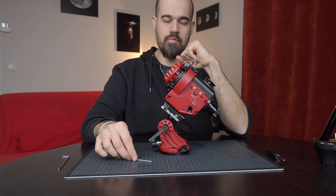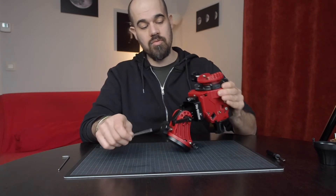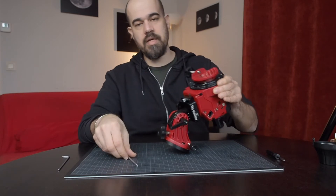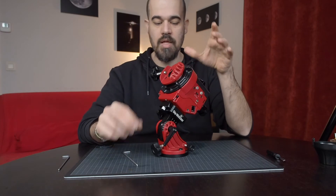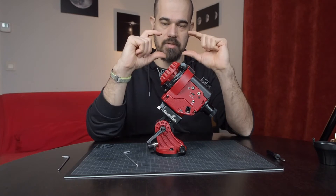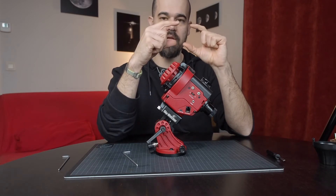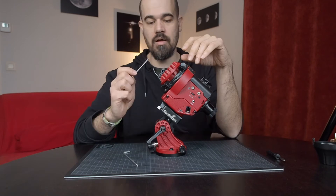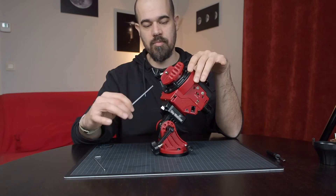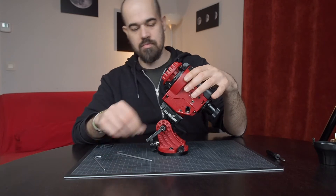If you need to start over with the meshing adjustment, you need to do a bit more than just unscrewing the worm gear meshing adjustment screw. That's because the worm gear assembly is not mounted on springs, so when you pull back the screw, the assembly will not back away from the ring gear. You have to manually pull it back. You have two ways: either remove the mounting platform and the clasp knob, or unscrew the base of the Star Adventurer.